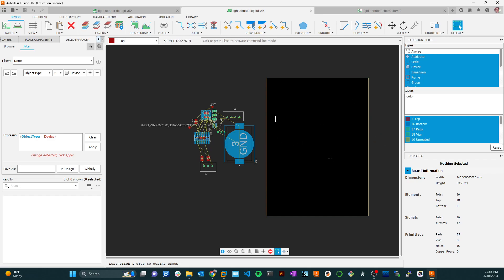The problem with this board as it sits right now is it's the wrong shape. We want to put this board into an enclosure — an Alexan enclosure that's custom. But before we do that, pretty early on in this process I want to add in the design rules I intend to use, and those are often driven by the board manufacturer. We're going to design this board with OSH Park in mind — OSH Park is a PCB supplier.